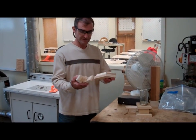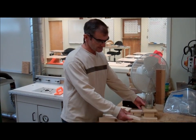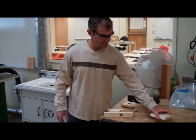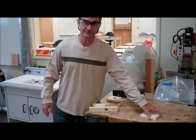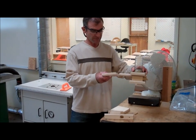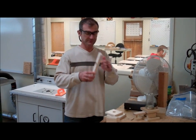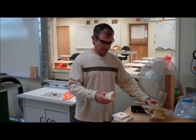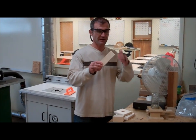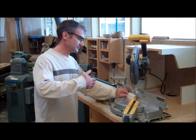I cut out my six pieces on the CNC router. When I was done, I took my base and routered it — on the base I only router one side, because when it's sitting flat you don't want an undercut. This next piece I router on both sides. The sliding piece I router all edges around. Then I have my other three pieces — this one has a 45-degree cut, so I take it over to the chop saw and cut it at 45, keeping fingers far from the travel of the blade with a good firm hold.